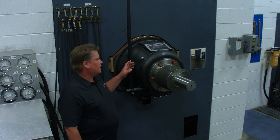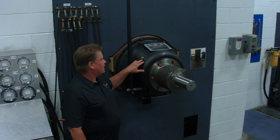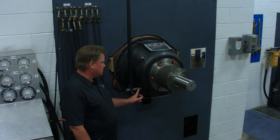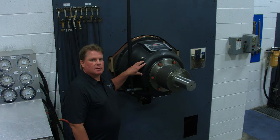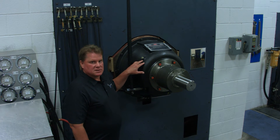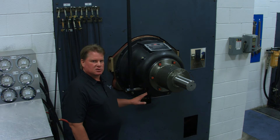This particular PTO has three lubrication points. There's a greaser for the throw-out bearing, a greaser for the main bearings that support the output shaft, and two grease fittings on each side of the housing that grease the operating shaft. All three locations should take a good quality number two lithium-based grease. The throw-out bearing and main bearings should receive three to four shots of grease every ten hours of operation, and the cross shaft or operating shaft grease fittings every thousand hours — give them a couple of shots.